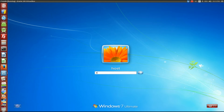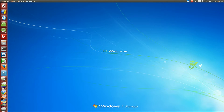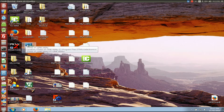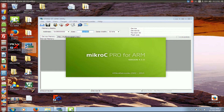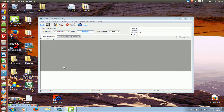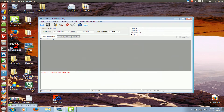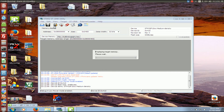My Windows is already started. I'm going to access it and open Micro C to show you some code, and also open the ST-Link utility that I'm going to use to burn the hex file that Micro C will create into the microcontroller. As Micro C is starting, I'll try to connect — and you'll see it tells me no ST-Link is detected because I'm in Linux. I do Ctrl+C to assign the USB to the Windows OS, and now I should be able to connect — and right now you can see it's connected.